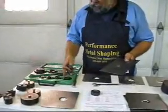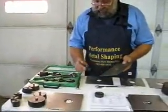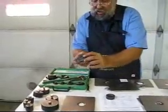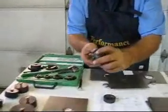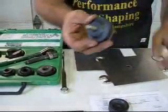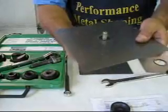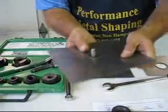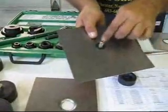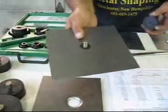The way we do it is we punch this out - this is a one-inch hole. Now, on the edge of the lip right here, there's a little bitty lip right here. Mittler Brothers has a neat little feature: by putting this little lip in here, if you don't get this centered, you have one side of the flare that's bigger than the other. This lip seats your metal right inside so you have a perfect match every time.